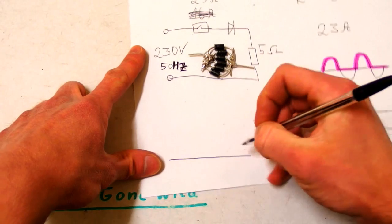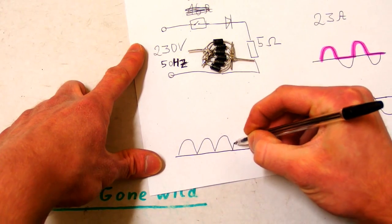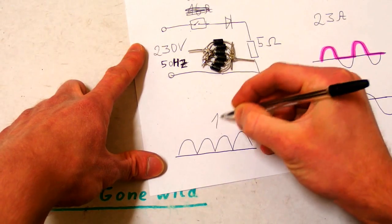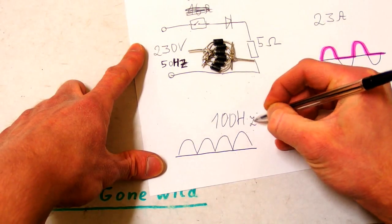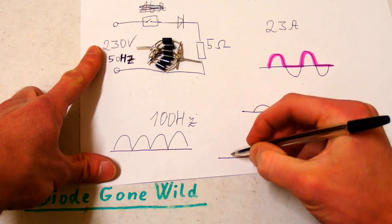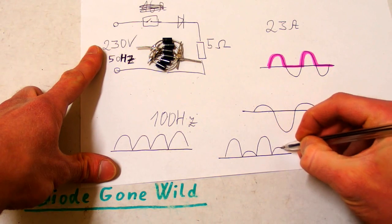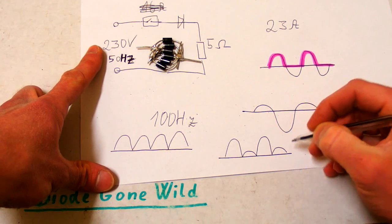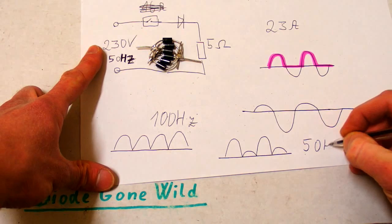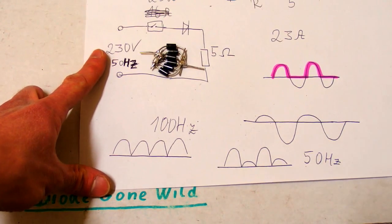And normally in a fluorescent tube all the half cycles would blend and make 100 Hz ripple, which is not visible to human eye, but because 1/2 cycle was loaded more, it was blended like this, and I could see a 50 Hz flicker. And the 50 Hz flicker, unlike the 100 Hz flicker, is visible to human eye.